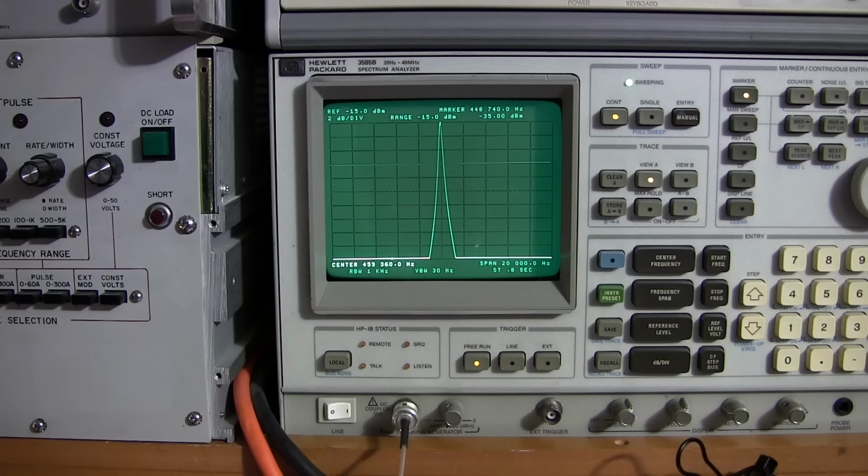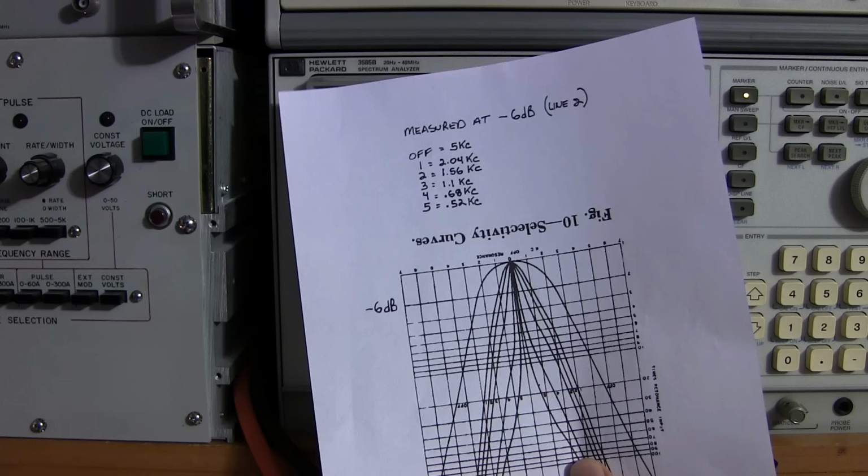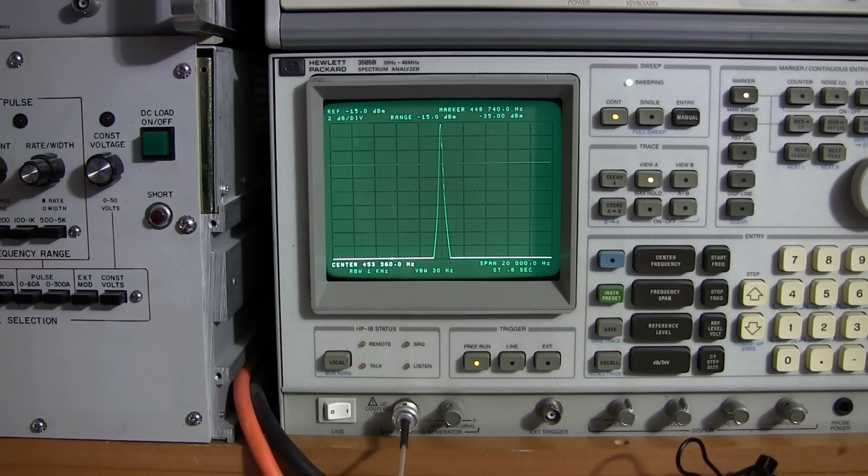And the tightest position here, which is this one here, again, the drop in gain is absolutely normal for these receivers. I'll just adjust the sensitivity control, and there is a lot left. So right now we're at 520 hertz and that's at the tightest position right here. And that closely matches the chart. This is about as close as you're going to get to matching that chart in real world conditions. I'll just put the sensitivity down here and put this back into the off position.